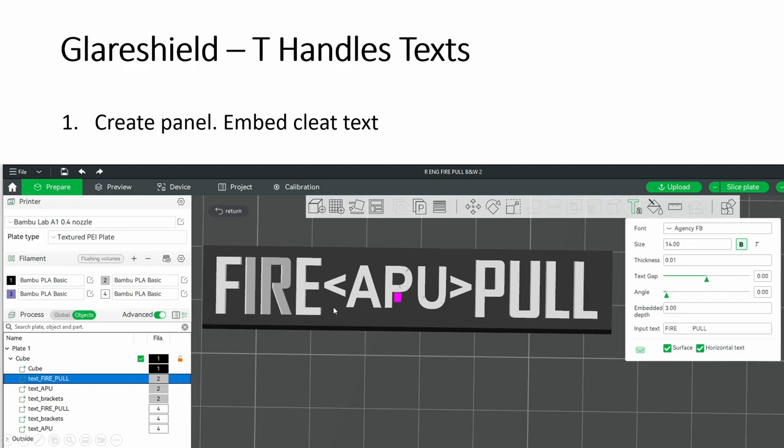Now for the panel, I started with FreeCAD in the beginning, and in the past I've always been embossing. Unless the text is very big, you get a lot of light bleed between the letters; if you do a cutout the text has to be huge. As mentioned in the last video on the F15 playlist, I started using the Bambu A1 printer — it's fantastic, especially the AMS mixing colors. So I had great success for the F15 light indicators, and here we are doing it for the A10. For the T-handles it's special in the sense that besides the black body, the text is clear all the way through. You need to paint it white at the top — if not, with the clear, it's actually hard to read the transparent letters.